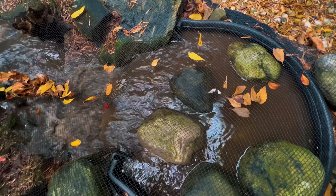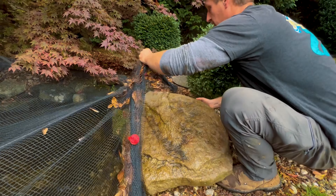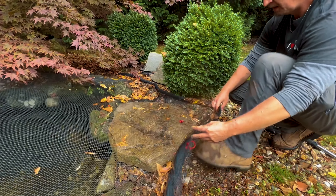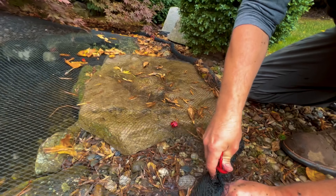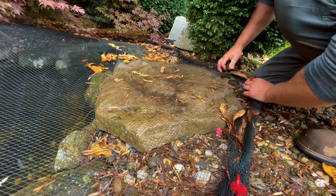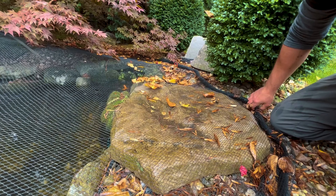The weir door locks in so we're able to service this and work in a dry environment. Now our water is flowing back into the skimmer and back up to the top of the waterfall. We've got the pre-filter mat in, we've got our basket in, so I'm just going to put the lid right back over the top of the skimmer and then I can pull my netting back and keep it nice and taut the way we had originally installed it. These stakes just go back into the ground.